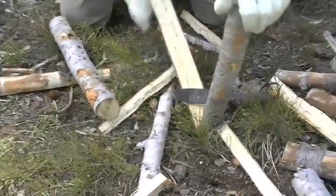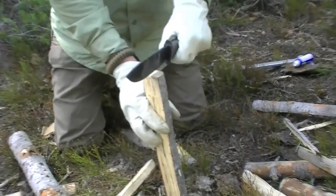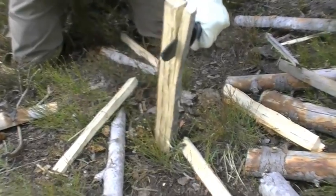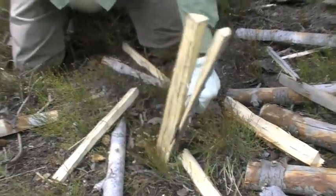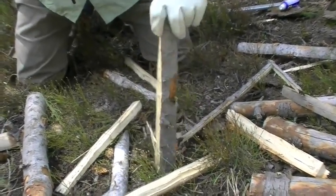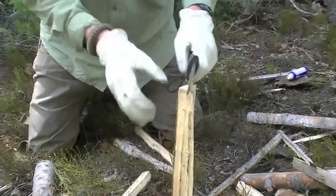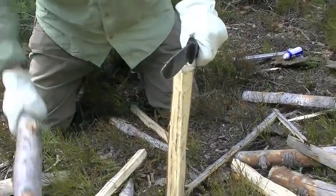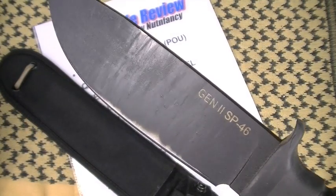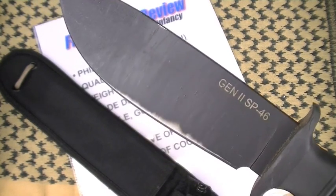I heat treated the blades in my shop, tested them, and then had metallurgical analysis done of each procedure to document them. I also added the snap temper step to the factory heat treatment. This is an operation I've seen done in other factory knives, but one that I have always used in my own knife making and is common in commercial heat treatment plants. What it does is relieve some of the stresses of hardening before the clamp and temper operation, and prevents any cracking of the blades while tempering.